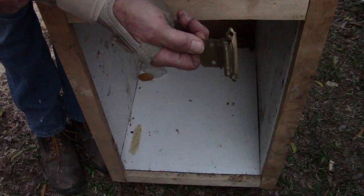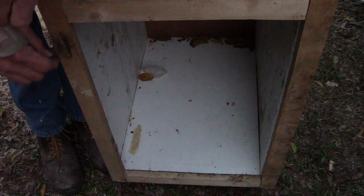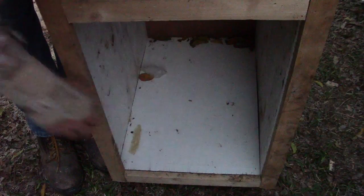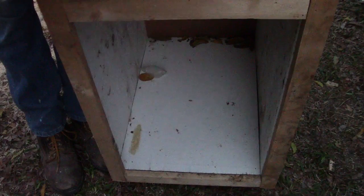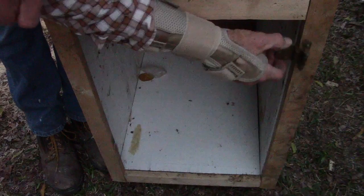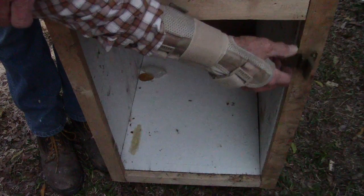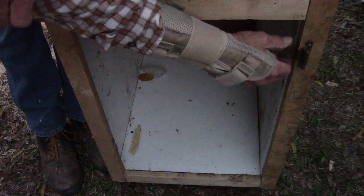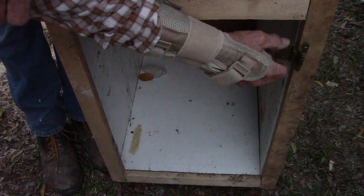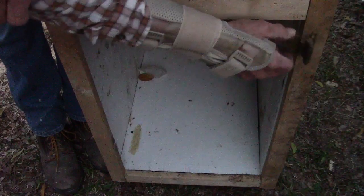And then came the overlay hinge. The overlay hinges were great — everybody loved them in the cabinet business. You could make your door, it didn't have to go on the inside, it went on the outside, and it could be a half inch bigger, which means you could have a quarter inch overhang on each side, top to bottom. You could still be a quarter inch bigger and it still worked. The only thing is in case you needed a certain amount of reveal between door and door, but that was never a problem. The hinges mount there and they could go pretty much anywhere on the style. Then you just put one screw in there, get them both in, and then you would adjust whichever way the door needed to go — up or down, back or forth — take the screw out, and then do whatever you need to line it up with the drawer front or the next door beside it.